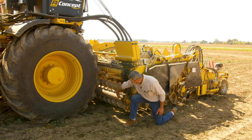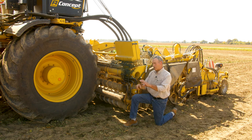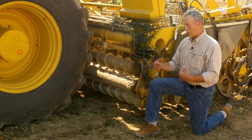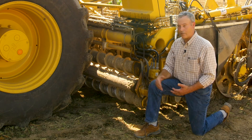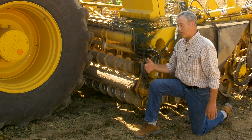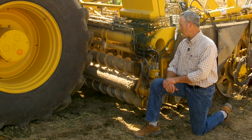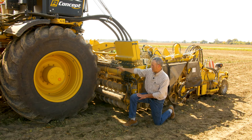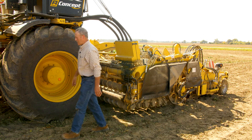On the back side here, there's a roll that's driven hydraulically separate from the rest of the head, and this one can be rolled counterclockwise or clockwise to act as a pinch roll to pull extra dirt out. Under dry conditions, you just roll it without the pinch so the beets can move easily to the center and through the rest of the machine. Or if you have a lot of weeds or stems in the beets — foliage still in the beets — you can have it acting as a pinch roll to pull some of that garbage out. As the beets move to the center, there's what we call the belly chain that transfers the beets from the head to the cleaning turbines.